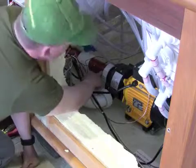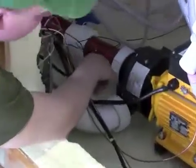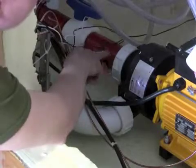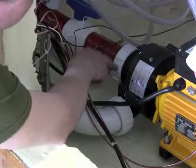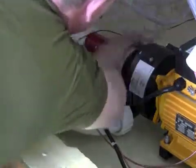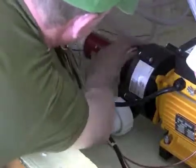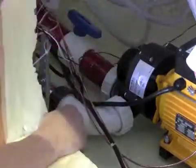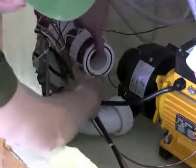The red pipe is a suction line. The red is always your suction line that comes into a pump — the suction always comes into the end of a wet end to pump the water. This is your two-and-a-half-inch suction union, and you just thread that off counterclockwise like any threaded fitting. You'll see there's an O-ring sitting right here.